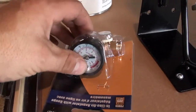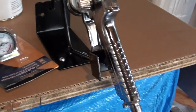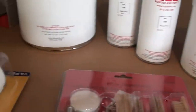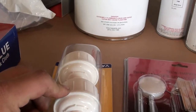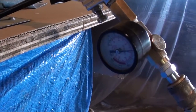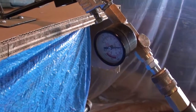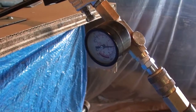I've got to install this regulator — it goes right on the base of the gun so you can actually regulate the pressure at the gun. I've got some cleaning supplies, and I've got to install these moisture filters for the compressor. I've watched a lot of videos and you want a regulator right at the end of the gun where you can control the pressure more accurately — you've got to buy this separately.